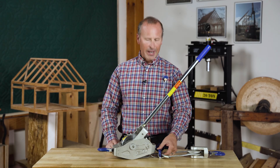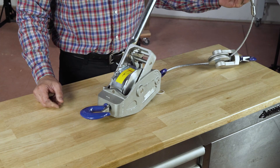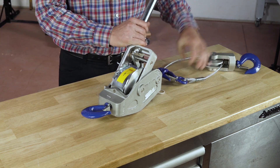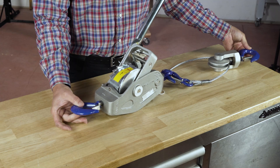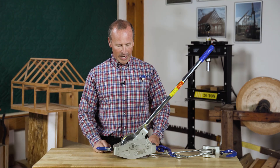The capacity on this is two tons. If you are single rigging it like this, the capacity is one ton. But if you hook it back on itself and use these two hooks to attach to your load, you get twice the capacity — two tons, four thousand pounds.